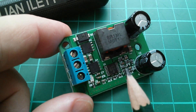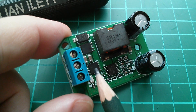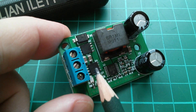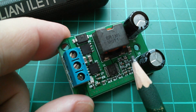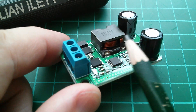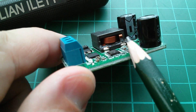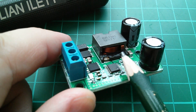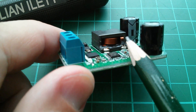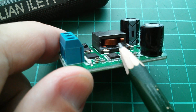This thing has a 5 amp rating, and that's relatively easy to achieve with the very low on-resistance MOSFETs that this is using. But typically the area where there are problems is in the inductor. Not here it would seem, because this inductor is quite intriguing — it doesn't appear to use enameled copper wire. It appears to be using some sort of enameled copper strip which is wound into a spiral.